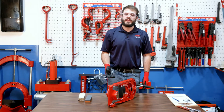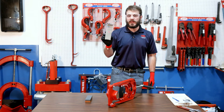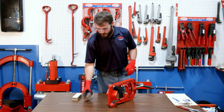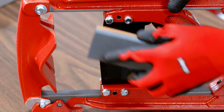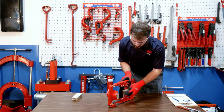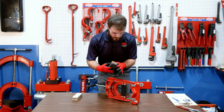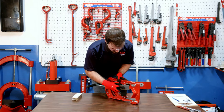Now we are ready for the care and maintenance of the blade. You can use any sharpening stone — any will work. You start on one side at a 30-degree angle from the tool, go down once, up once, spin the tool around, do the same thing: up once, down once.